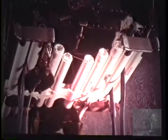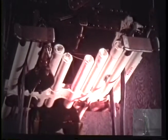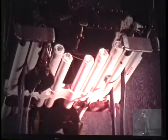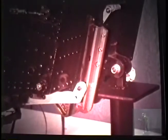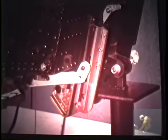In the Mark H7 seat, additional thrust is provided by a rocket motor attached to the bottom of the seat bucket. This rocket assist gives the seat a 0-0 capability, safe ejection with the aircraft sitting stationary on the deck. A thrust angle adjustment arm, which engages a guide track on the seat main beam, maintains an optimum thrust angle for the rocket motor when the seat bucket is adjusted up or down.